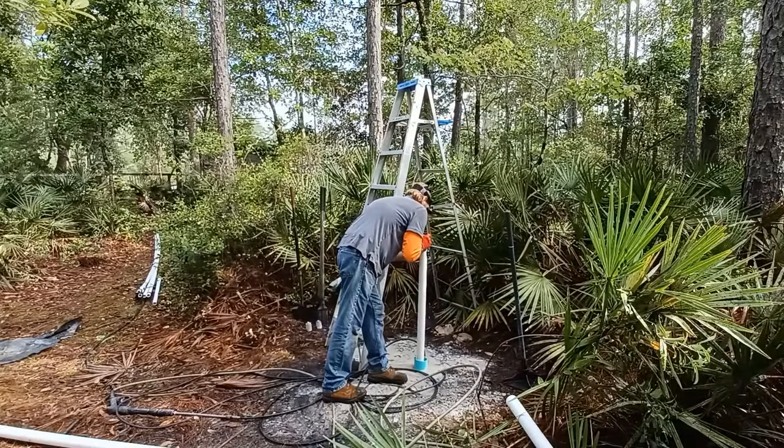And what we're going to do is a new idea. We're actually going to see if we can use the mud pump and push this 1-inch pipe down there, and just blow all that sand out, because I'm pretty sure that it just filled up inside of that 2-inch shaft. And as soon as we get down there 30, 40 feet, we'll go ahead and reinstall the new well point down in, and we should be good to go.